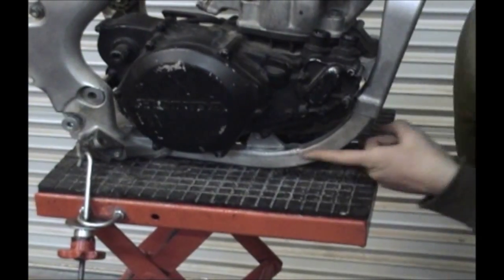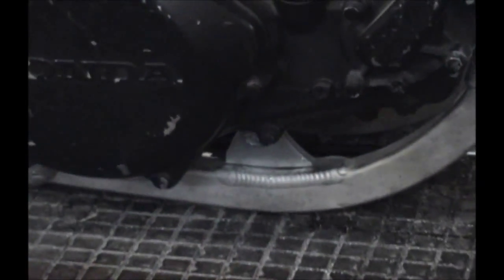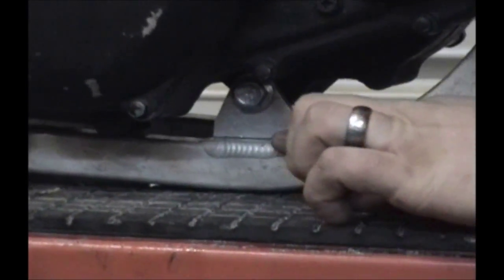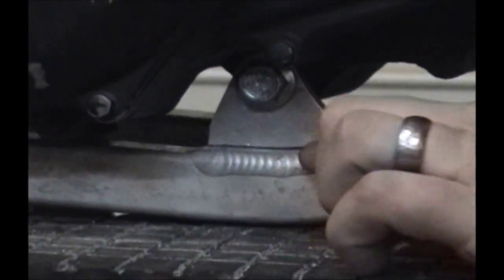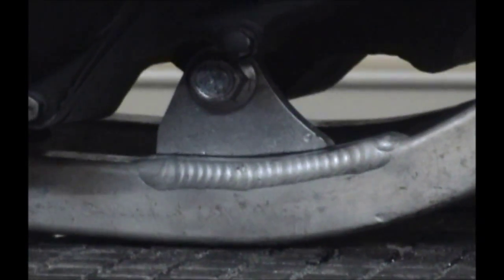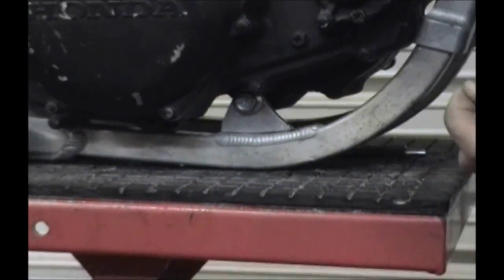As you can see, we've got this bottom mount shaped. It's okay if there's a little bit of a gap there — you don't want more than about an eighth of an inch gap, because anything bigger than that your welder's not going to be able to compensate for.